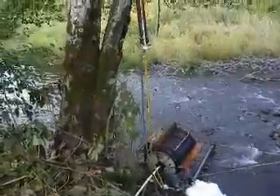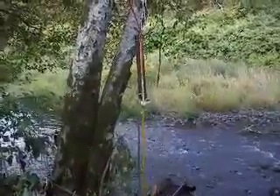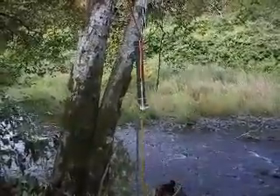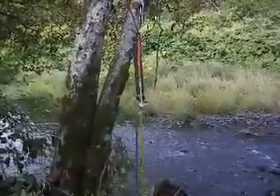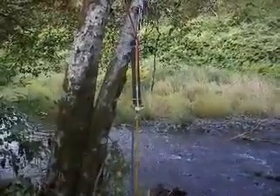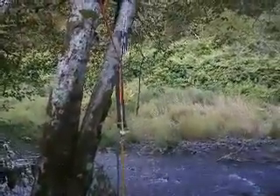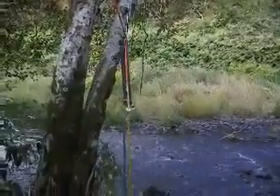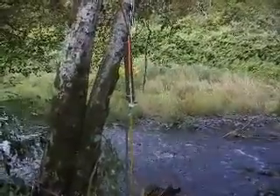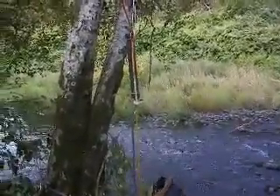It goes up the yellow line into what I call an air-water separator. This separates out the air that is trapped from the water. The air is directed into a three-eighths inch line where it enables it to lift the water higher. The five-eighths inch hose runs over to a five-gallon bucket suspended in the tree, currently at about twenty-five feet in the air.